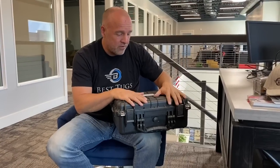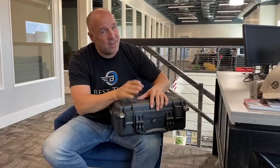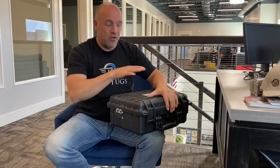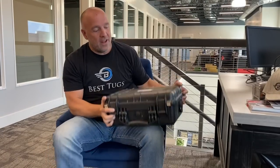I don't want to call it weatherproof, but if it starts sprinkling — where other boxes, the air vents allow water to get into the equipment — you've got 120 volts, an AC to DC converter, and a lot of circuitry trying to make clean power. The water can get in there and wreak havoc on your equipment, and of course your airplane is the biggest concern. These vents are cut so that if water runs down, it keeps channeling it away from the equipment, not dumping it inside.